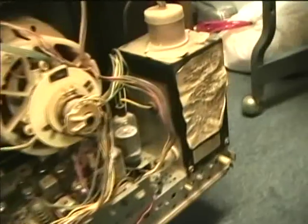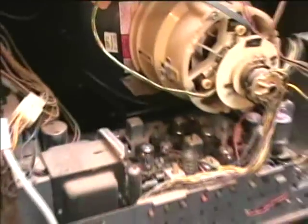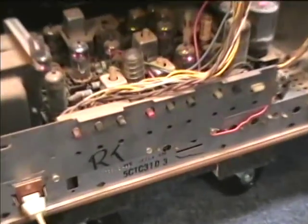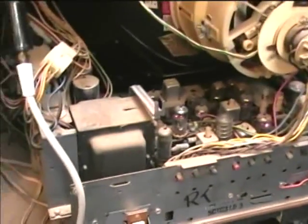Let me turn it around here and check the tubes. Original CRT — 22UP22 — and I really like the gray glass faceplate on this. It doesn't exhibit any of the discoloration you sometimes see on this age of tube. The volume's kind of weak. I'm not sure if this has a volume limiter control or not — it may just be a weak 6AQ5 tube.